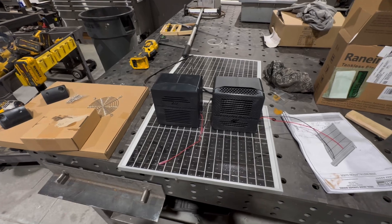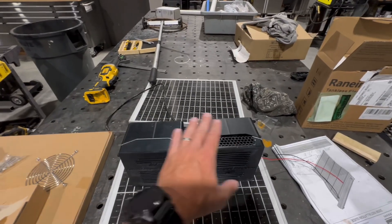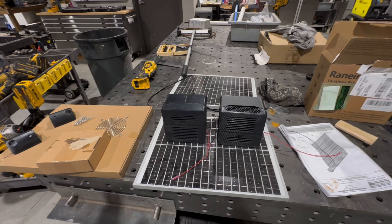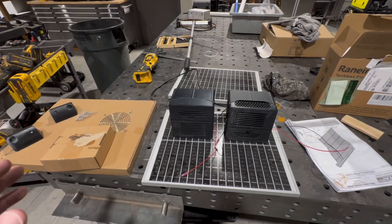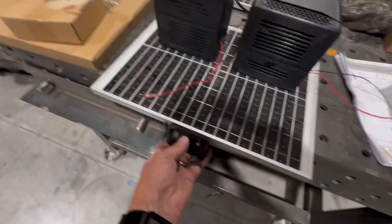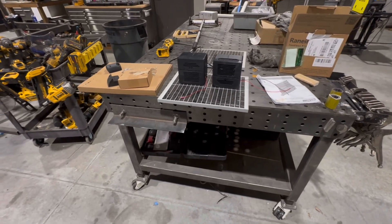The solar blaster on Amazon sells for $300. We sell this whole kit for about $150 to $200 installed, and we can also sell and ship them. We put a lot of time into installing solar fans and getting the entire fan system and shroud set up, making everything as least intrusive as possible on the container — meaning cutting into the container as little as possible. What I hate about the solar blaster on Amazon is it only has a 5-watt panel, the fan barely spins, and we had problems with them — plus you're cutting a hole in the roof of your container that you can never undo. We bond the solar panel mounting brackets to the roof so we're not drilling into the roof. We hate drilling into or cutting into shipping containers — if we can avoid it, we always do.